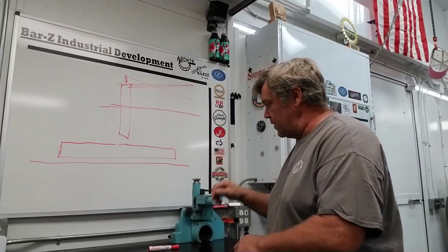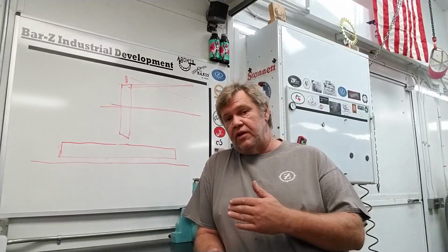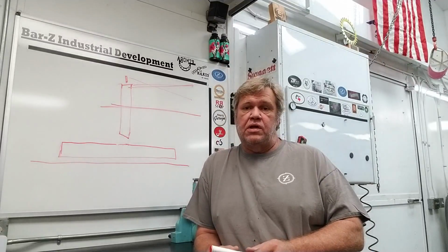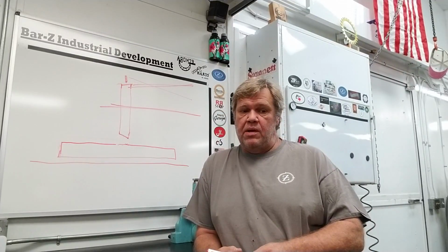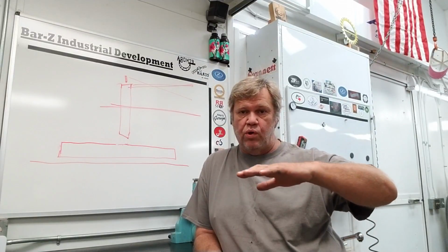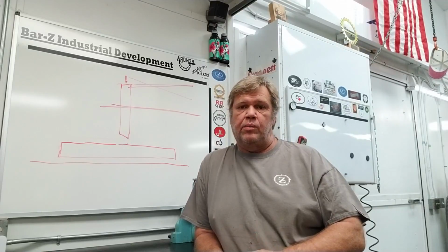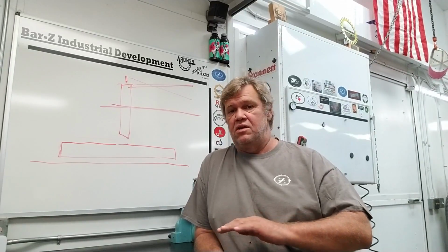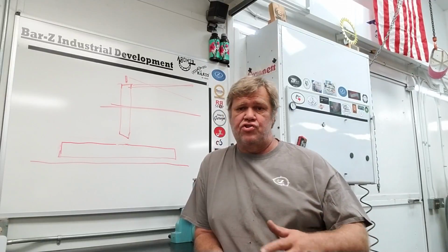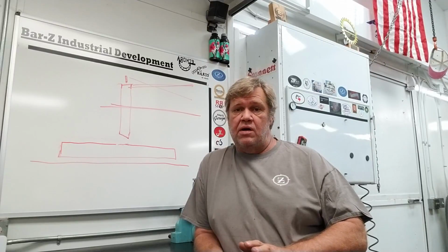And I can't think of a good way to do it and measure it. Thankfully, that jacking bolt's right out where you can get to it, and it's just going to be a matter of putting it in, making a dress, doing a little grinding to see which edge is leading and trailing, and make very fine adjustments until it gets dialed in, until it's actually working properly. And then after that, man, you don't want to touch that thing. It's like after grinding your chuck, you don't want to pull it. So it's going to be kind of an install and be done with it kind of thing.